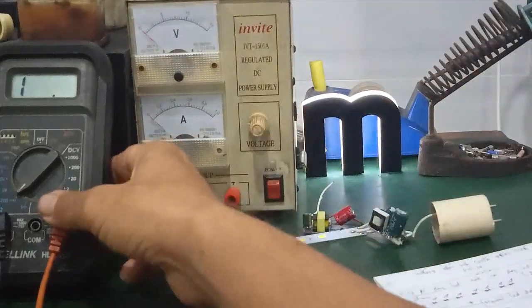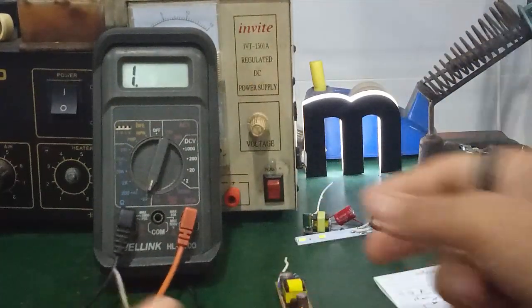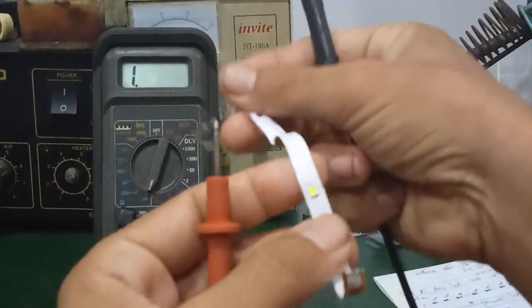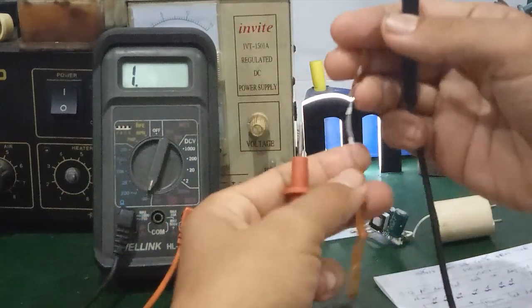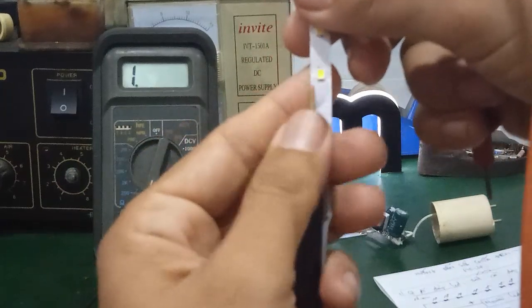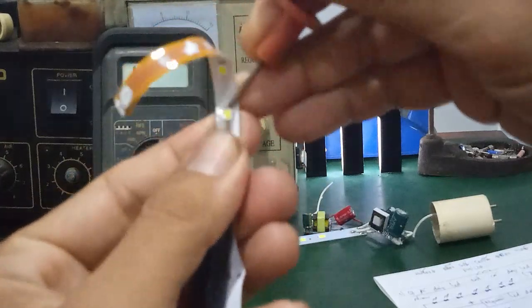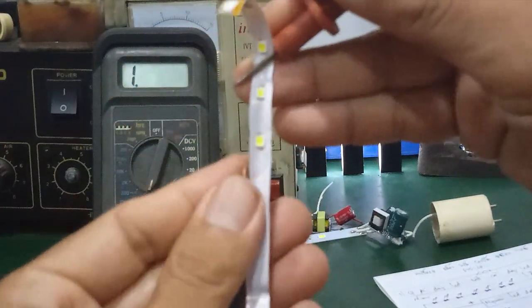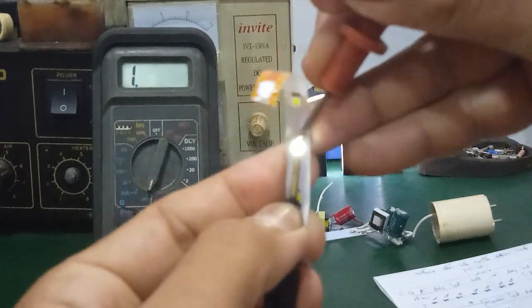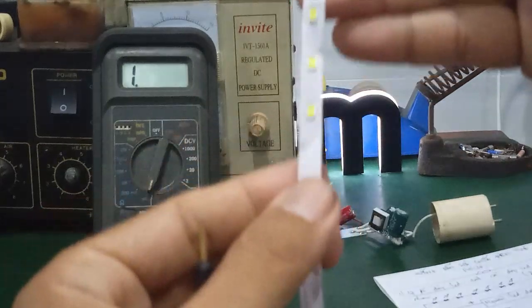To check the chip LEDs, I use the diode measurement mode on the multimeter. If the LED strip is broken and not lighting up, just check normally. Be careful because this strip is very easy to break — it's glued onto the silicon and glass rim. Check each LED one by one; a bad LED can be replaced or bridged over.